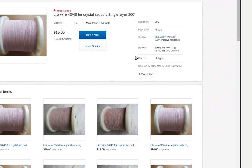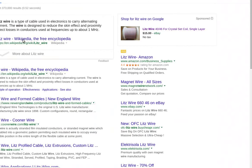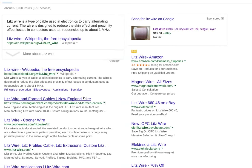Wait, hold on a second. Zero gauge, zero is fat. I beg your pardon? Zero is fat, right? Yeah. Let's see. So, Litz wire. Where's the fat wire? Are you saying flat? Fat. The zero gauge. Okay, this wire is going to be like 0.14 millimeters, so gauge 29. Where's the zero gauge? The whole bundle of wires equates to a zero gauge? It's effectively about zero gauge. Okay.